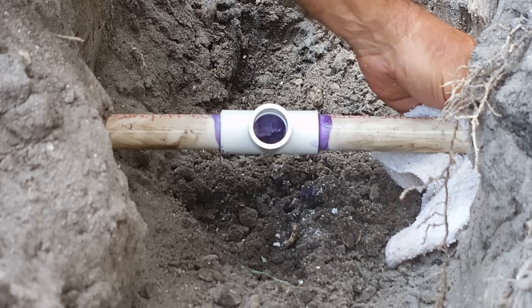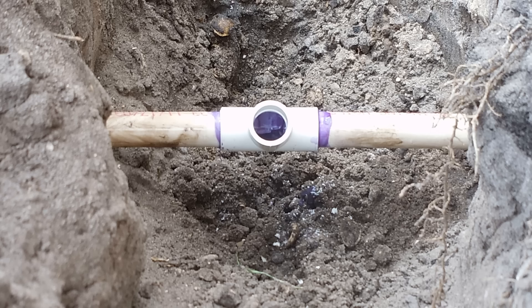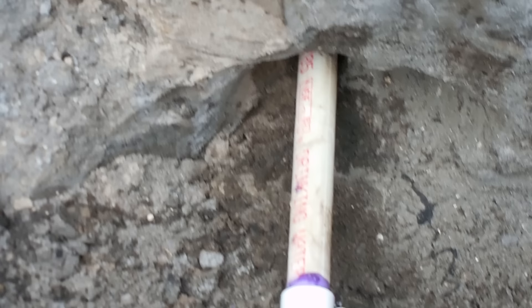The last thing you're going to do is take a cool damp rag, feel the pipe to make sure it's nice and round, then wipe it down until it's nice and cool. If there's any kink in the pipe that's an indication that the pipe was cut too long for the T — make sure the pipe is not cut too long before it slides into that T fitting. And right here you can see how nice and straight that pipe is.